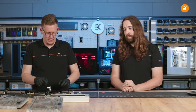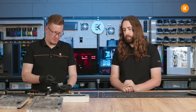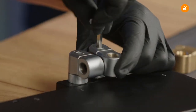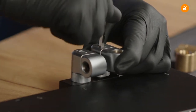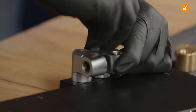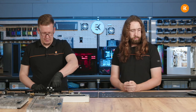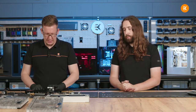So this is the 21 millimeter, and one more neat feature is the 6 millimeter Allen key at the top, just like we have for the micro ones. If you have a tight space to install it, you can just go in with the Allen key from the top and screw it on all the way without even needing to touch the knurling at the bottom or turn the fitting itself. And there you have it. We have 21 and 28 millimeters of offset.